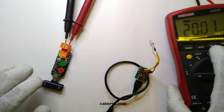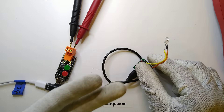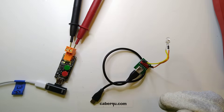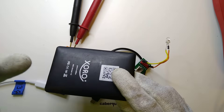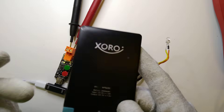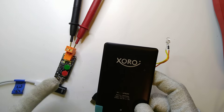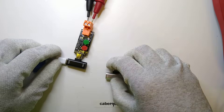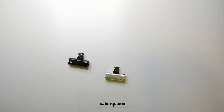I've unplugged it, but it's still outputting 20V — the power supply didn't even realize something was going on. It was capable of frying my simple LED and resistor circuit, but it could also cause real danger. For example, if I connect this to my Bluetooth speakers they may break, or even worse, if I connect it to my power bank, it may burst into flames, because this power bank is not rated for input higher than 5V. That's why I would definitely not recommend using any kind of splitters like this where you can request voltages different than the regular 5V.